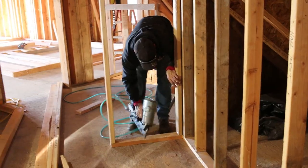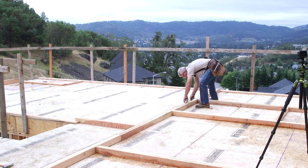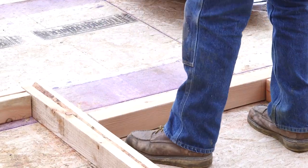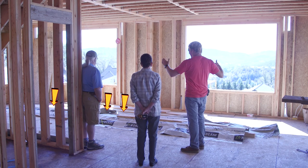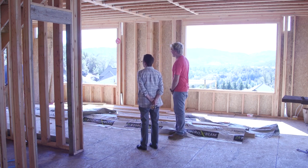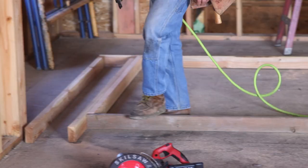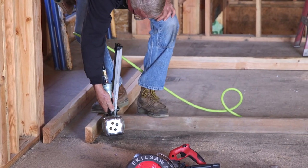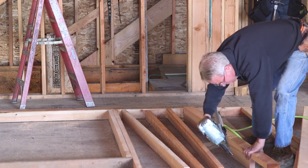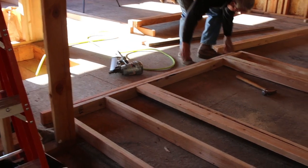If you remember back to when we were first working on the second floor, the upstairs, you'll remember that we snapped, plated, and detailed all of the top and bottom plates for all of the walls. Well, those plated wall segments have been sitting downstairs in a stack in the living room all fall this whole time — dry, protected, covered up, and ready for this moment. The lines that we snapped have long since worn off or at least faded, so the first thing we did up here was freshen up those chalk lines so those wall segments would go right back into the right spot.